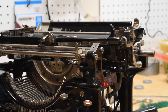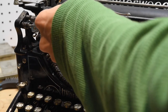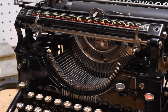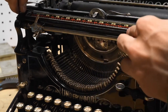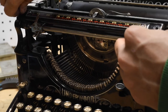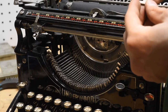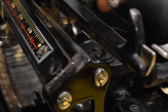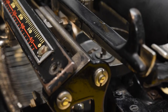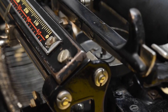There's one thing about the line scale I do want to point out. When we put in the line scale, we're going to slide it in from one side to the other and seat it on these two holes. There are two screws — one is a little bit longer than the other. The short screw goes in on the left side and the long screw goes in on the right side. There are no threads for it there because you have this little L-shaped stopper that also goes in. It goes in with the little L piece facing the left side, and it can be tricky to hold in position. Once you have that taken care of, the little L piece bracket should tighten back up onto it and hold everything firmly in place.